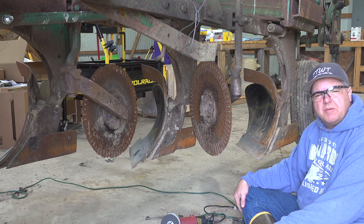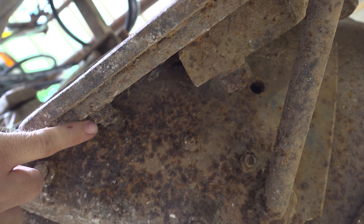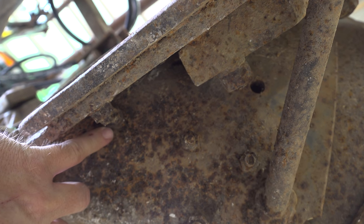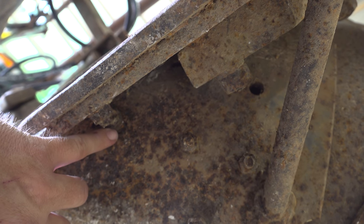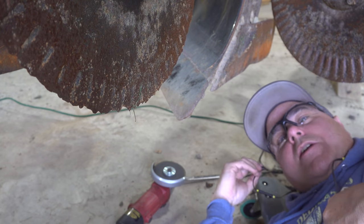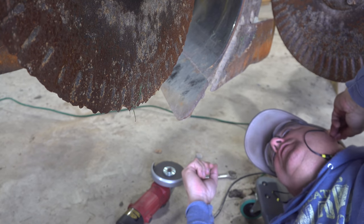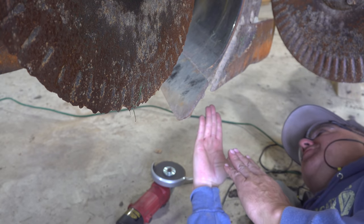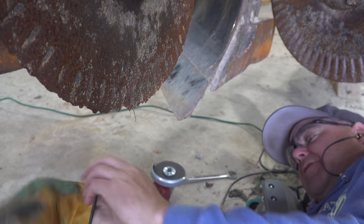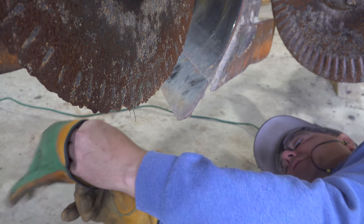This is not the most pleasant job in the world. Underneath the plow now — that right there is the bolt I'm trying to get off. This bolt's in the way, so we can't get a socket on it. Can't even get a box end of a wrench on it. So I'm just going to take the cutoff wheel and grind about half or two-thirds of that nut off and then see if I can get it to come out. I've worked to make sure the steel cuttings are going to go away from me, but I've still got long sleeves and gloves because a sufficient number of those steel cuttings do come back and they're a bit warm.